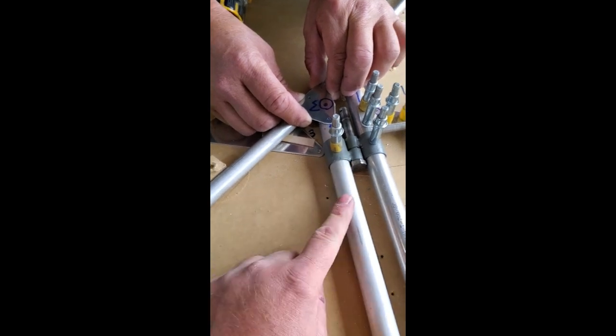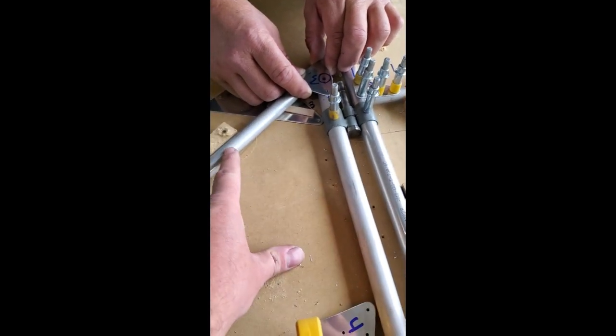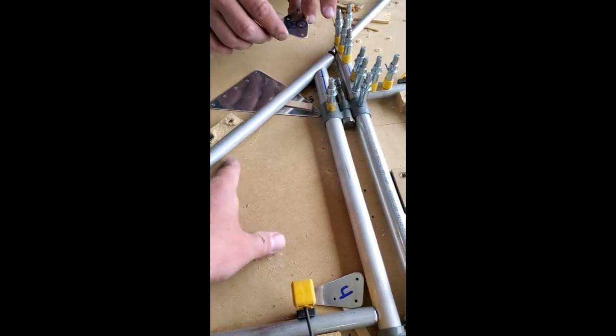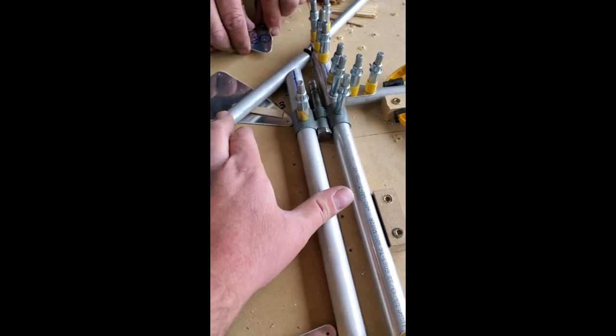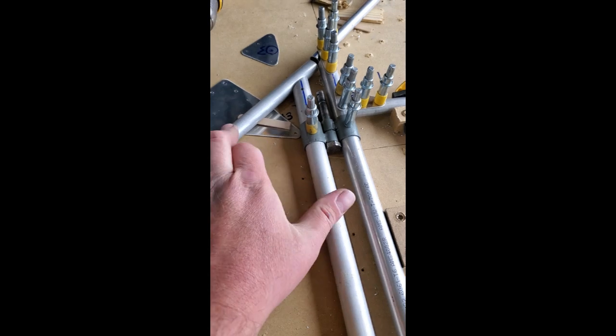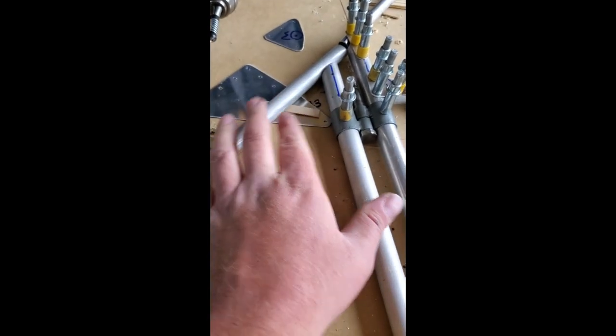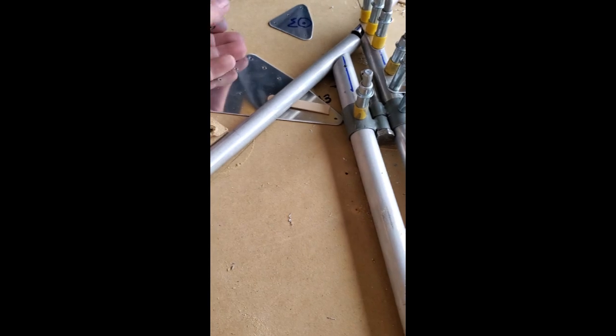The reason for that is we've got a three-quarter inch diameter tube here and a five-eighths diameter tube here. So it's always going to have an illusion of not being perfectly square because it can't be. And you can see our fancy shim here — it just happened that that gusset really perfected the shimming.